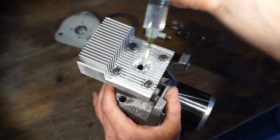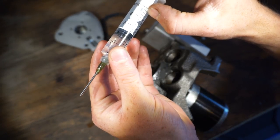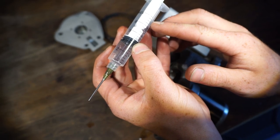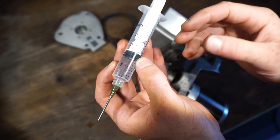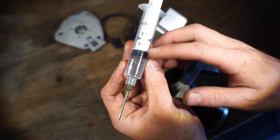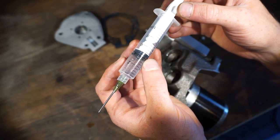So in total, we've put 6 milliliters of water into the engine. And so we started at 1/2. We went to 6, so that means we want to take 1/2, make that 1, because usually a compression ratio is 1 and a larger number. So let's double everything. So we have 6, double that to 12. So technically it's only about 12 to 1.